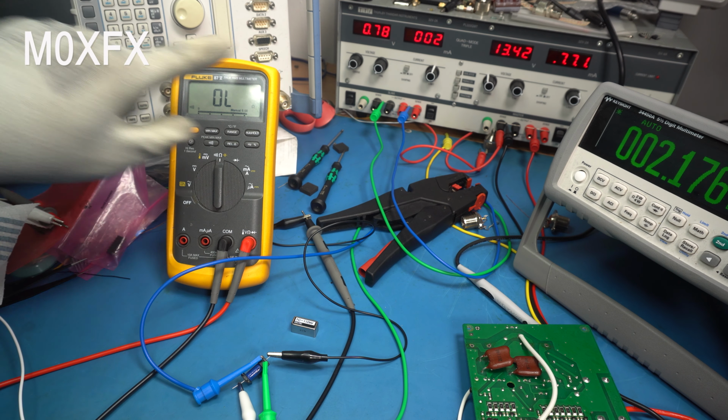We'll do a continuity test on the antenna socket. So that's one side of this connected to the multimeter. I'm on continuity. We're in receive mode. I've also got the RF shorted out, so no RF can go into the PA. Now if we go into transmit, switch to antenna B. Yeah, and put that one on there. So we're working. Now I will say, this thing is an absolute nightmare to put back together, but we've managed to do it.